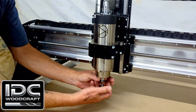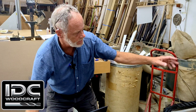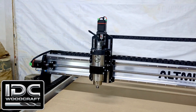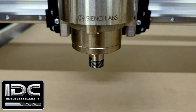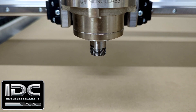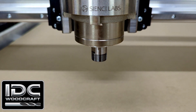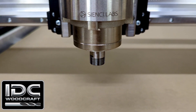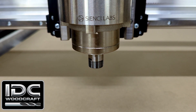The first thing you want to do when doing a spindle break-in is take all your tools and collets off. I'm going to start this — it does it 10 times, but I'm only going to run through the full cycle once. You'll see it go up to 7,500, then 15,000, then 20,000, stop, reverse, do the same thing, and then start all over again. Here we go.